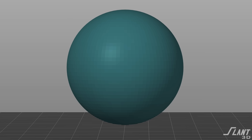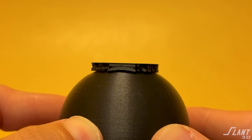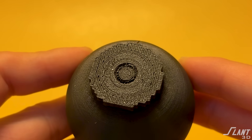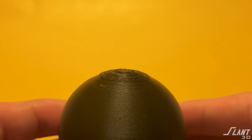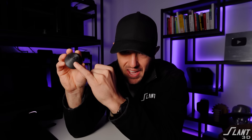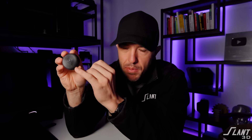We have eight different versions to show. The most basic version of printing a sphere is to set it down on the print bed and let support generate around it. The issue with this is that you end up with an unintentional little flat side, and very often the support is not even that good. When you pop it off, you can see deformation on the bottom — an outer ring where it goes from flat up to starting to curve, and then shrinkage. It gets really tough to make it clean and crisp, and you have that little flat edge which messes with the look of the sphere.